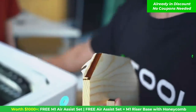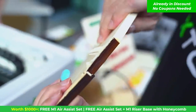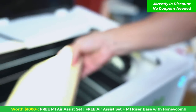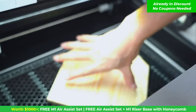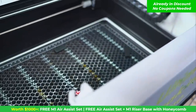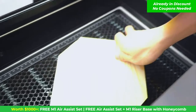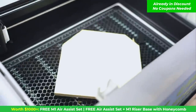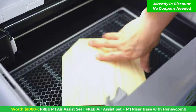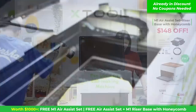I didn't open the air assist. I forgot to open the air assist. So that's without air assist, it's very hard to cut through. Let's try if with the air assist we can cut through it or not. Let's make a comparison. Without the air assist, the max cutting ability for pine wood is about 8 or 9 millimeter, but it depends on the material. If the material has more water in it, it will not be that good.